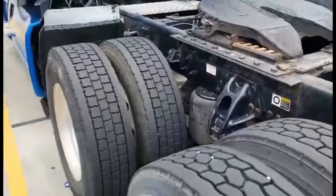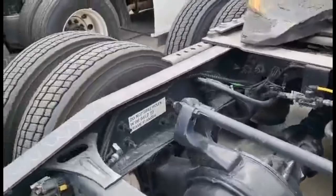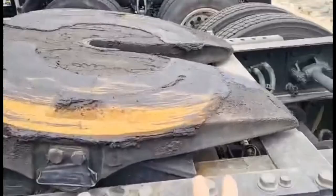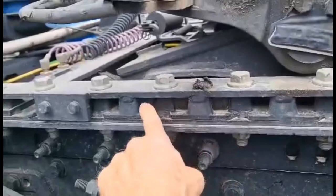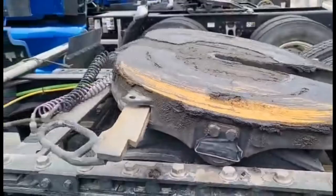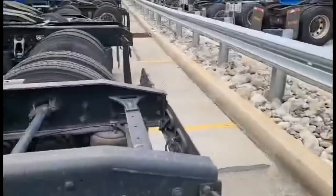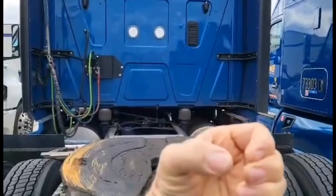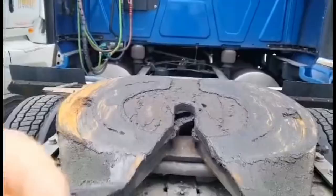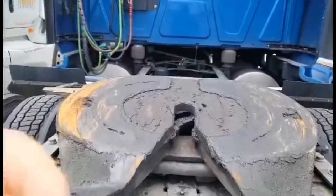Just as a little comparison, I'll look at my neighbor's fifth wheel here, and you'll see a different assembly. Instead of having those teeth on the inside, there are spots over here, and here are the locking lugs. So when you go to adjust your fifth wheel, these pins move away and you can slide to a different position, and those pins will lock into different places. The cylinders and air hoses are in a different position too. My fifth wheel uses two lugs that come in from the side and grab the kingpin; this one uses a solid bar that goes across the kingpin and holds it.